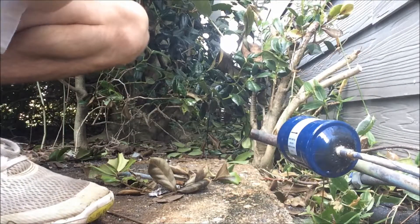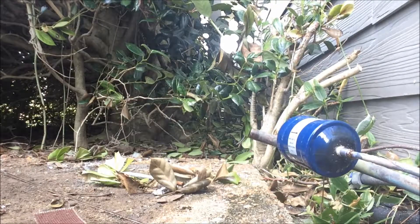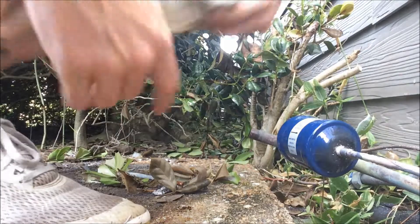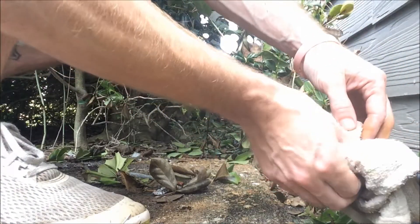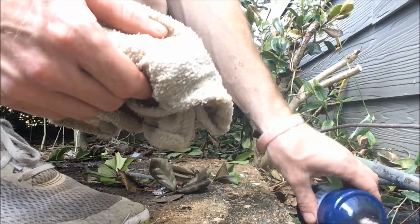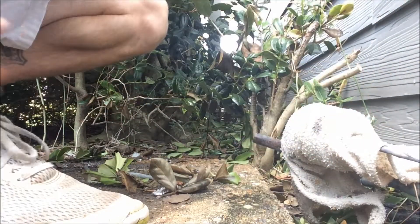Cut your torches off. You are going to need a rag — you want to cool this off. Obviously it's going to be extremely hot and you will burn yourself; I have done it so many times it's ridiculous. Your filter dryer is extremely hot — you just kind of want to set the rag on there, wrap it around, and let that chill for just one second.